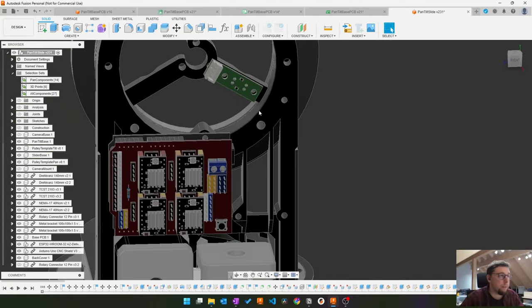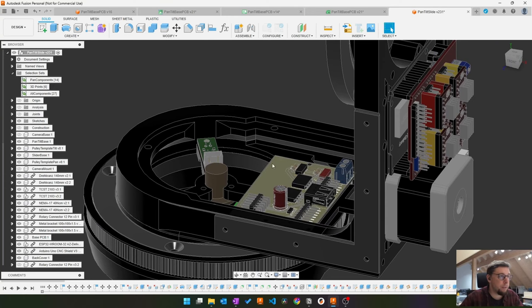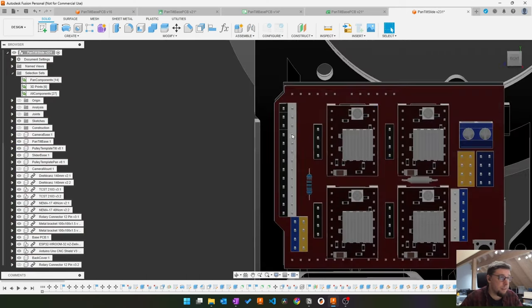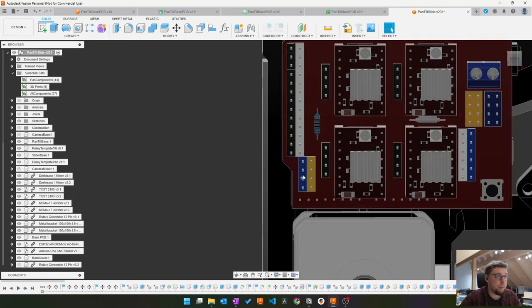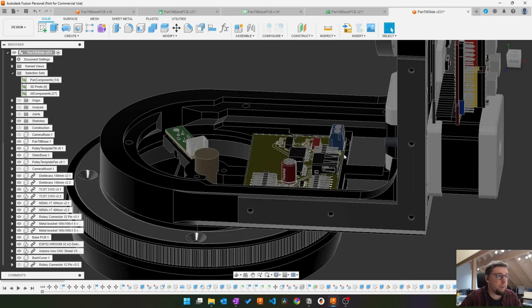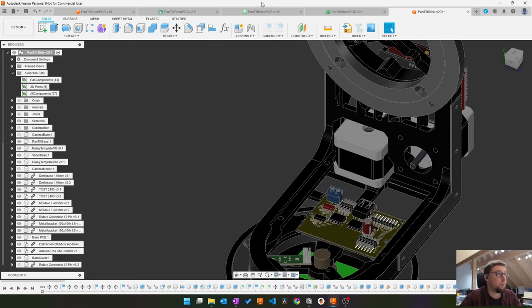Same thing here. And I want to pull down these cables all the way to the base PCB here. And this one gets plugged in here as well. And then everything is routed to our new 6-pin connector, which will then be an 8-pin connector, and gets distributed up here, because see these black and white strips here, they are for the end stops, and this one here is serial and power and all this stuff. So I will pull everything down here, sort it out, and then move it up with one single connector. That's what we're gonna do.